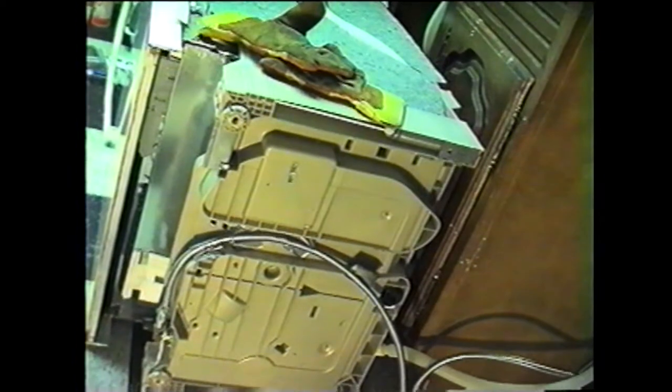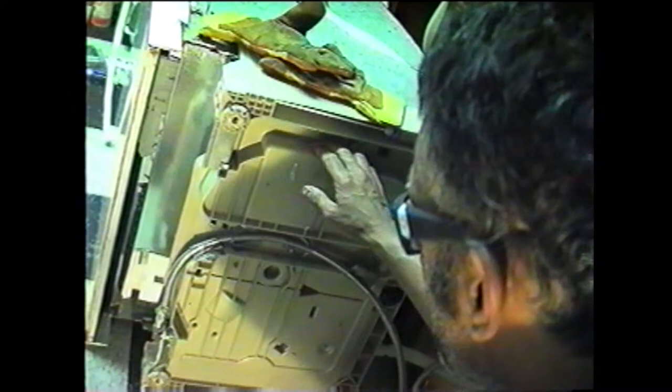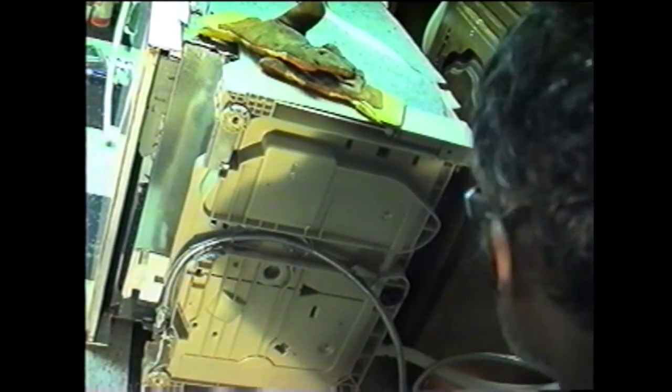You can see the ground wire is actually longer. The issue is that this cord is probably not as long as I'd like. There's a little attachment on the wall I'm going to pull out to get a little more room. This is what I pulled out to get a bit of slack. I think I have enough to make the connection, but I'll have to put the dishwasher back in and make sure the wiring is coming right underneath it to the junction box.